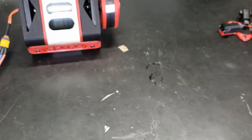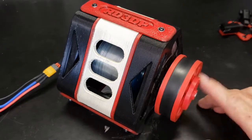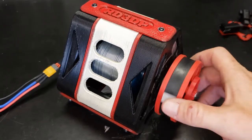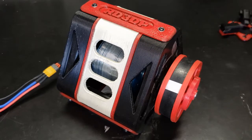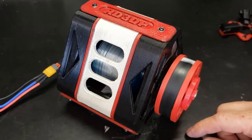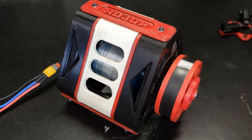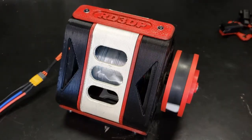And I think I want to even go with an 8-pole motor in a Halbach arrangement to focus all the flux on the outside of the rotor to increase the magnetic field for more torque. Because where I want to end up with this design is to put it on my boy's electric dirt bike and see what that does, see if it can haul him around. It'd be kind of cool to have a 3D printed motor that propels a little kid around the yard. That'd be awesome.